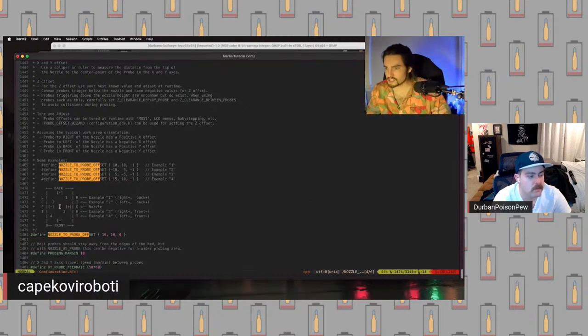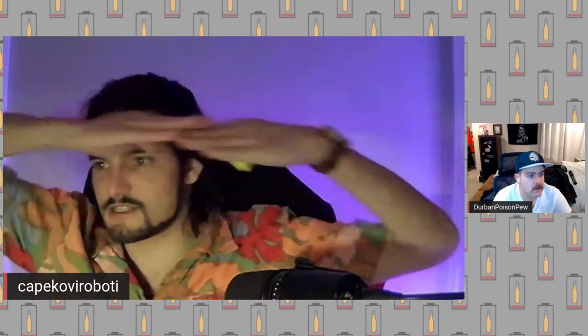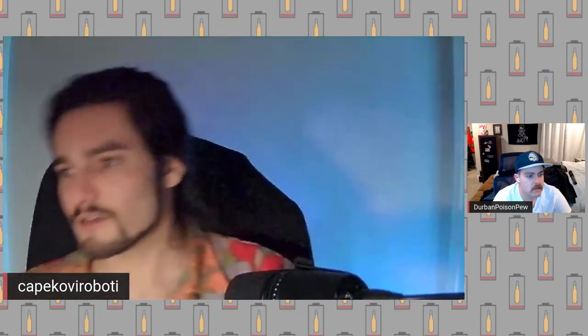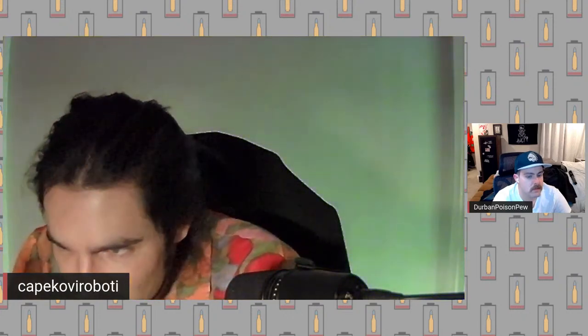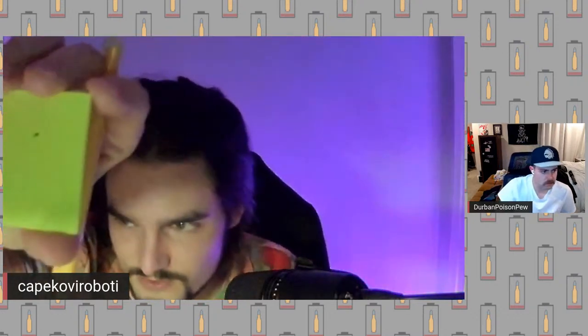So I'm going to show you a sweet little technique. I'm going to switch. Where did OBS go? So the technique is as follows. If this is the gantry, we're going to lower the gantry all the way to the bed. Then we're going to get a piece of paper, right? And on that piece of paper, we are going to get a pencil. And we're going to slide the piece of paper underneath the nozzle. Then we're going to make a point for the nozzle, right?